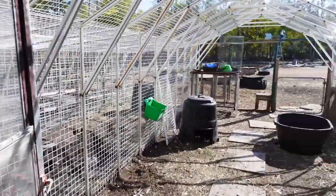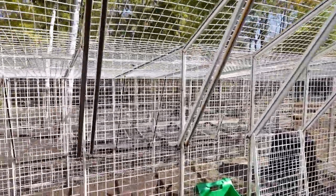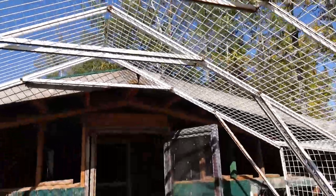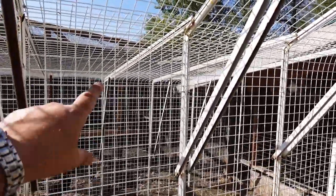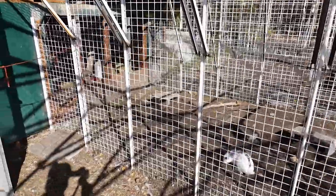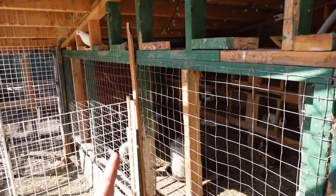So this is going to be the next area. We've had a dry run putting the tarp up. What we're going to do is put poly up, 6 mil poly. And on the peaks, I believe we're going to use, we talked about using carpeting, but we may even use that pond liner again on there and then out on the exterior corner. So this will all be sheltered in to the dry, sheltered from the elements during the winter and rain. And we probably won't need to cover this area off that we usually do.